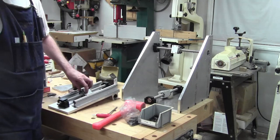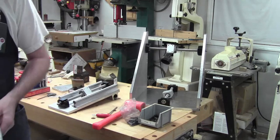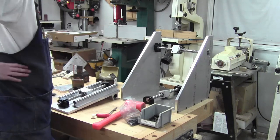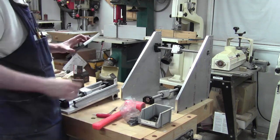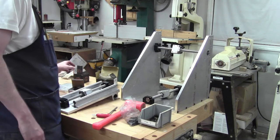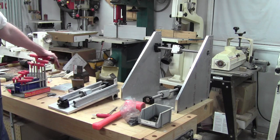Okay, this hole pattern here, the nut here, this thing, the hole pattern is wrong. I got it wrong on all three of them. It's the one area I relied on specs for, but I'm pretty sure I picked the wrong specs, I guess. Damn. It means I need to make new holes and new counterbores on all these. The nice thing, one of the good parts of this, though, is that none of those lead nut locations need to be smack dab in the middle.